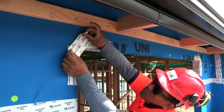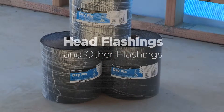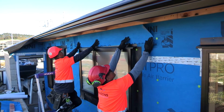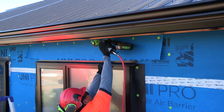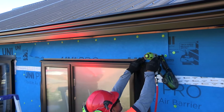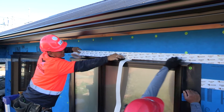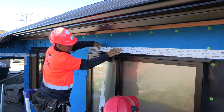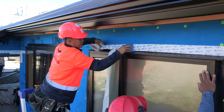To create a seal at the junction, install butterflies at a 45 degree angle at the joinery head flashings. Fit Masons Dry Fix plastic DPC up the side of the window jambs and run under the head flashing. Correctly install the DPC to the jambs and the second layer of UniPro over the head flashing to provide superior weather protection — both during construction with no cladding in place, and superior durable deflection and drainage over flashings for the life of the building. For the head flashing and other flashings with upstands such as wall and roof junctions, start from a natural break in the framing line above, such as the soffit or joinery above. Bring a second layer of UniPro down over the head flashing upstand as shown in E2/AS1. Use the same double layer of UniPro method for apron flashing and any similar wrap flashing joins as per E2/AS1.